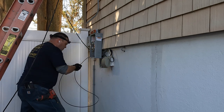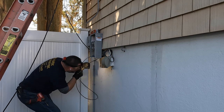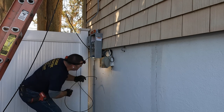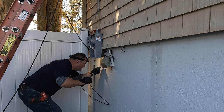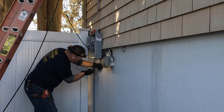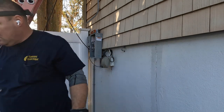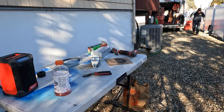Before I get to all the wiring and the panel downstairs, I want to make sure my grounding electrode conductor is in place. This is the two ground rods - the grounding electrode conductor from the two ground rods gets connected inside the main breaker panel inside the house. What I'm trying to do is push this wire through behind the old 100 amp service wire behind the mounting board, then I'll pull it around to install it inside the panel when I get down to the basement.